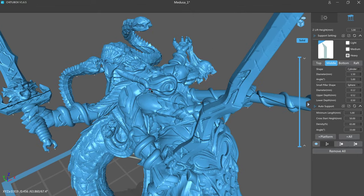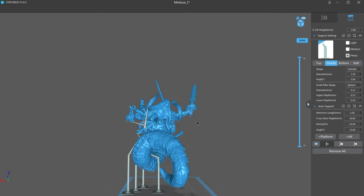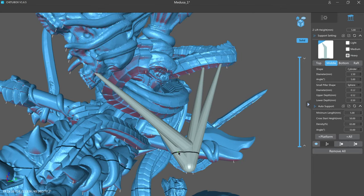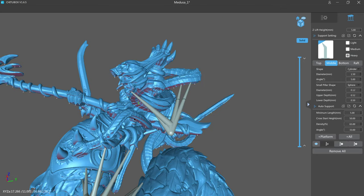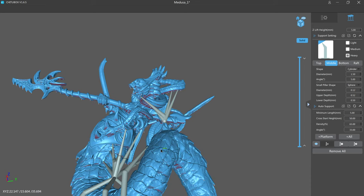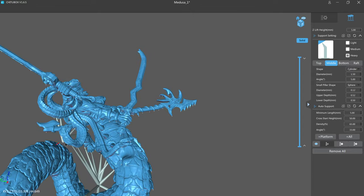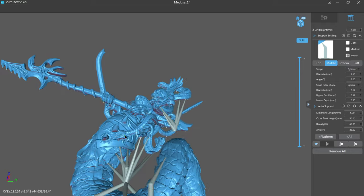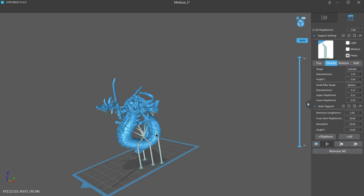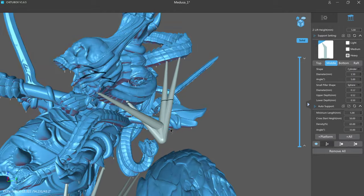And in this case, I want to keep as many supports off this part of the model as possible. That's why this is just such a huge game changer. The fact that I can now build off this, because even though it's not ideal, I can get 3 good-sized supports on that. There'll be a long span, but because they're 1 millimeter, they can deal. I mean, you can do a 1 millimeter span almost unsupported from one side of the build plate to the other. That's chunky.